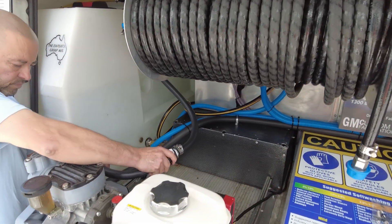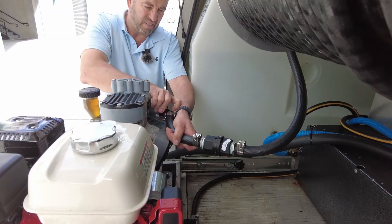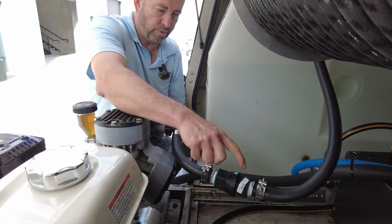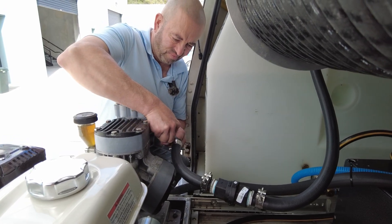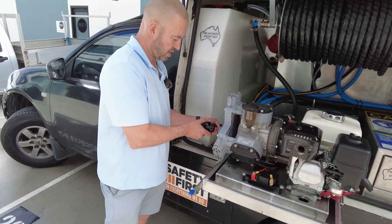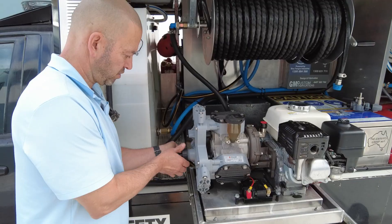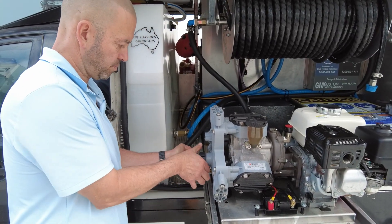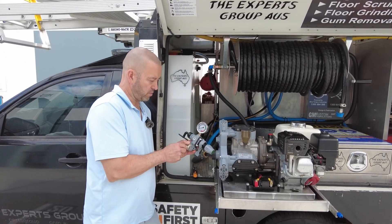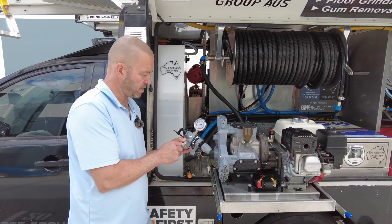Reconnect the pump outlet — on this we're running three-quarter, 600 psi high pressure hose. It's just great, we don't have issues with it. 300 psi check valve, good quality clamps. The pump outlet is a bit different, so we're going to pick up on a centre port here. Always lube up these O-rings — they're pretty hassle free, these fittings. We're running inch inlet, 600 psi hose. Another great addition in the kit is we've finally got a pressure gauge, so that's going to enable you to set up at different pressures and see how the thing's performing. 290 psi max on this particular P40 pump combo.